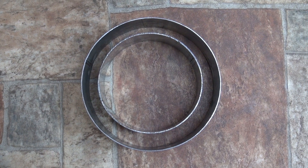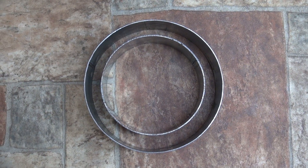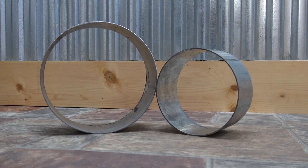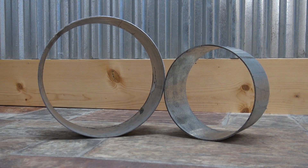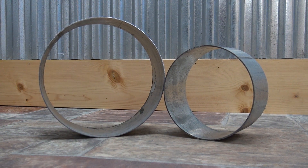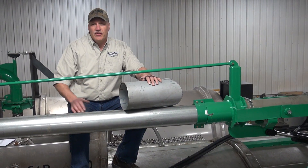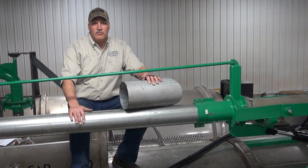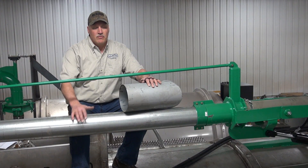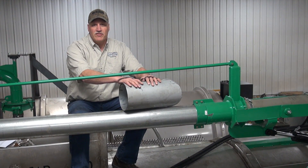You can pick either a 6 inch system or an 8 inch system. Our 6 inch system pumps 1,600 gallons a minute, while our 8 inch system pumps 3,300 gallons a minute. For instance, this 7,000 gallon trailer equipped with a brand new 6 inch system will unload in just under 5 minutes. With an 8 inch system, 2 minutes.